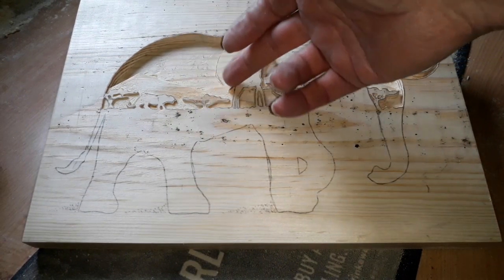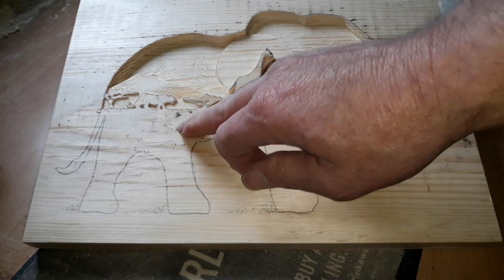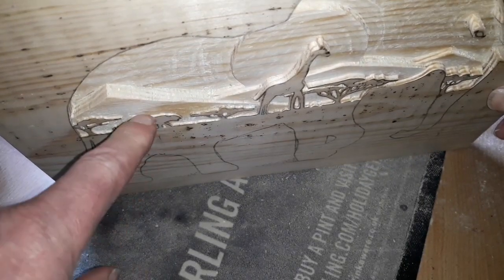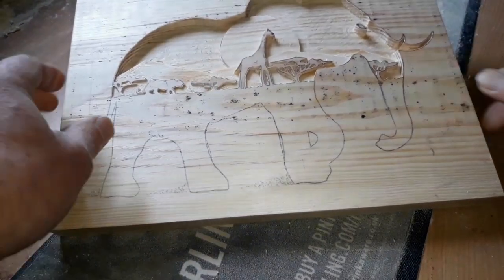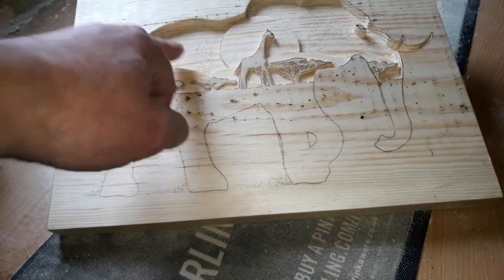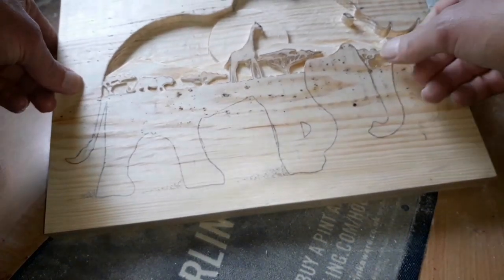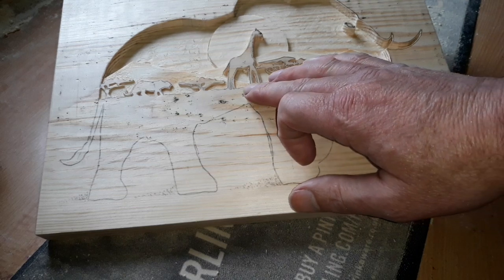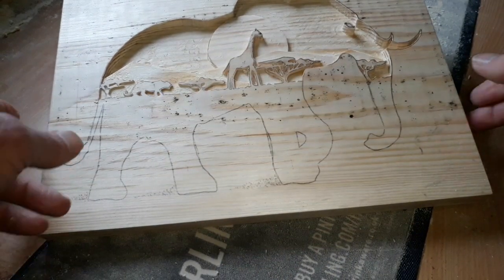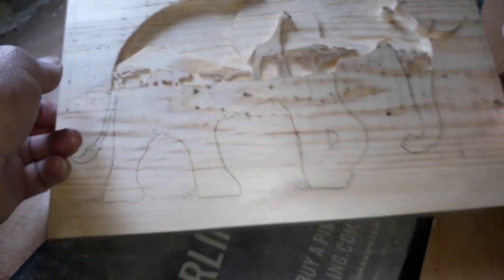We've done two, three, four, five levels — this is the last section to take out. The only issue is, you can see how thin that is, so I'm going to be a bit careful. If I really wanted to lower this down, I'm going to reduce that again, reduce that again, reduce that again. There's plenty at the front here because it's number fours up here, so plenty of depth. We'll remove the trunk area and up to the giraffe, then just go around the edge on this one and blend it all in. It'll all work out in the end — you can see the effect we're going for. So let's take out the trunk area next.